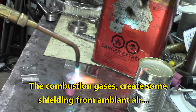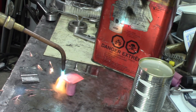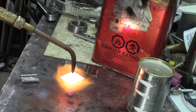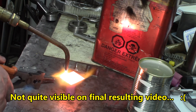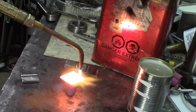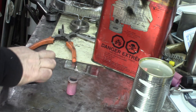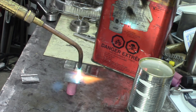It's getting orangey, and you're going to be seeing some current in there — some brighter zones. On the side there it's starting to appear, which means the carbon in the part is starting to ignite a little bit. Not too much because the flame is carburizing, but we're there. We'll do all the other ones like that and I'll be back.